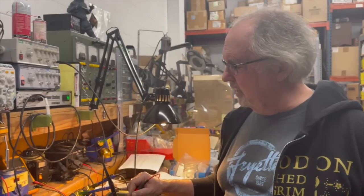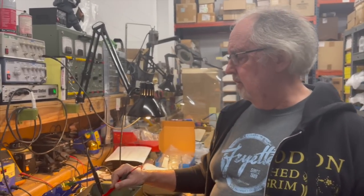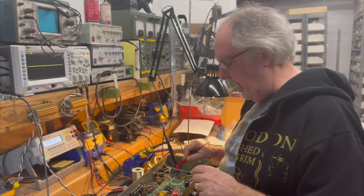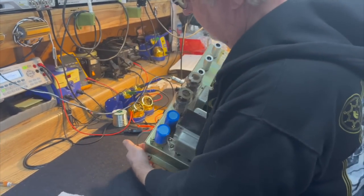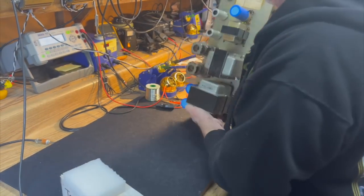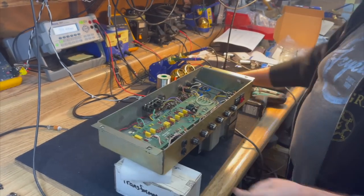In a JTM 50, 470, 480. In an Orange, more. In a Hiwatt, you'd expect to see 430 to 450 in either one of those models. So this is really set up not to fail. Why did it fail? Do one more check to find out. Well, the one thing I am going to tell you is no changing the cap. This is absolutely unnecessary. Now, before I go to the banging on the tube test, let's go back and look at a fun thing called ripple.